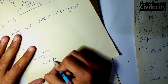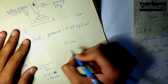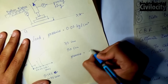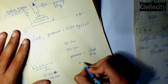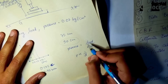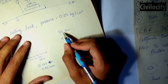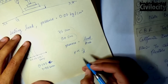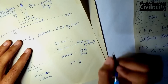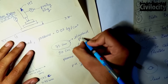These values are taken up to 1.75 mm. The plates are available in two different diameters: 75 cm and 30 cm. Since pressure is inversely proportional to diameter, a smaller diameter plate gives more pressure than a larger one. In cases where the 75 cm plate cannot cause 1.75 mm settlement, the 30 cm plate is used. The 30 cm plate is mainly used in highway pavements, while the 75 cm plate is considered the standard plate.